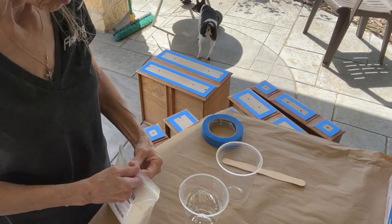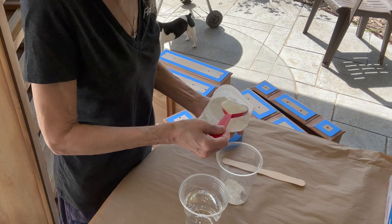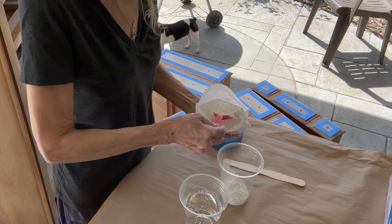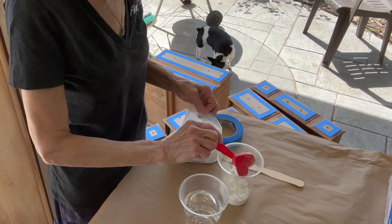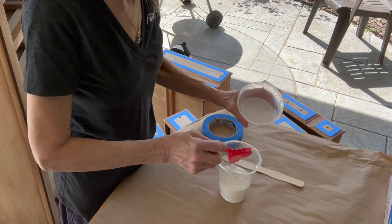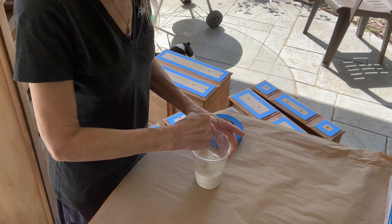Next I'm going to make my own chalk paint. I'm using calcium carbonate — I'll mix eight tablespoons of the calcium carbonate to eight tablespoons of water for one quart of paint. If you saw my demonstration last week where I tested the different types of chalk paint recipes, you'll see that this one turned out the best. Mix your water in a separate container first, then pour it into the paint — don't mix it directly in. Mix it up really good and make sure none is settling on the bottom.